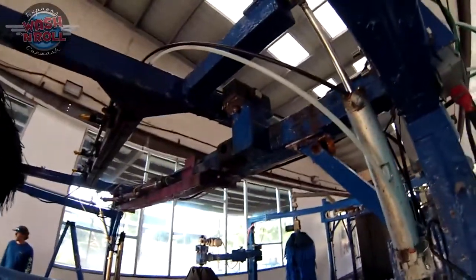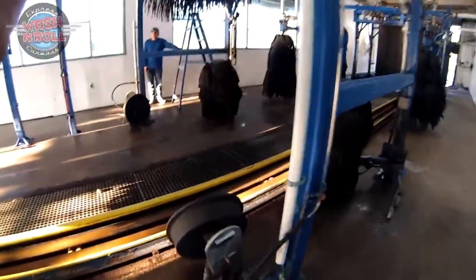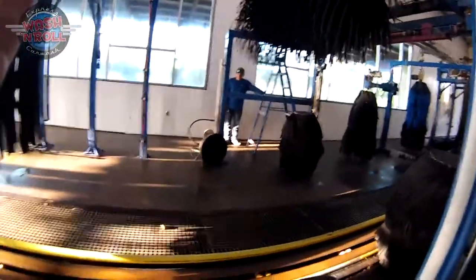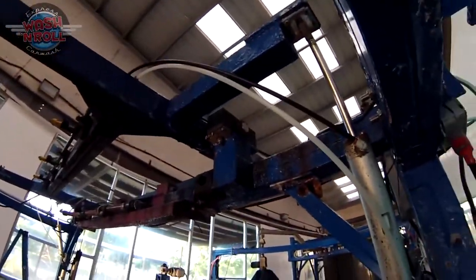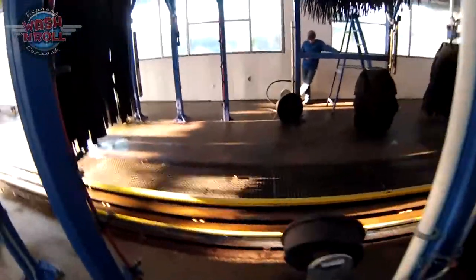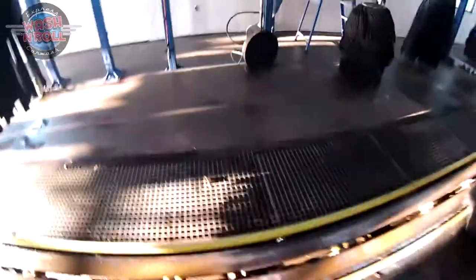There's also a stopper right there with a grease zert on top — same as I explained on the other side. At stores four and five you have the wheel pendulum. On this wheel pendulum there are two bearings on the bottom on either side, so that's four more bearings to grease, plus two more of those black stoppers at the very top with a stainless steel rod and a zert on top.